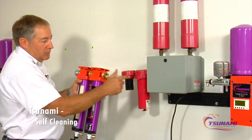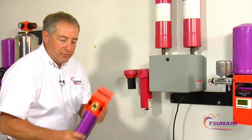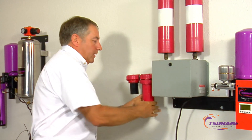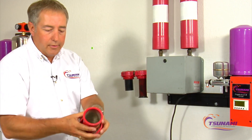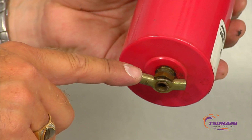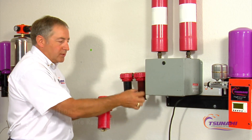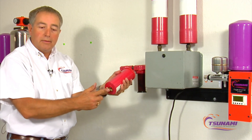The first stage filter then goes into a second stage coalescing filter. On many systems out there, the drain on the coalescing filter is basically a manual petcock, so you have to rely on manually servicing it. As you collect oils and filter out particulate, the oils drip down to the bottom and you need to manually drain that.